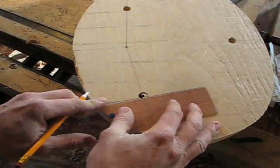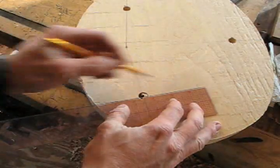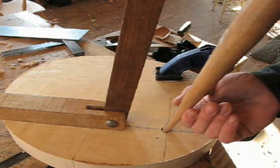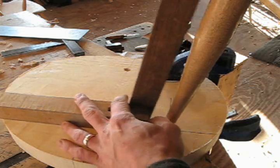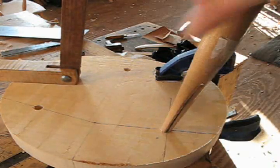Next, I need to create what I call a baseline. This baseline helps me create what is really a crosshairs right down the center of that hole, which is going to help me sight my angles when it comes time to do my reaming. I start out by putting the reamer into the hole, and then lining up the straight part of the shaft of my reamer with the correct angle. This just helps get me started in the right direction.